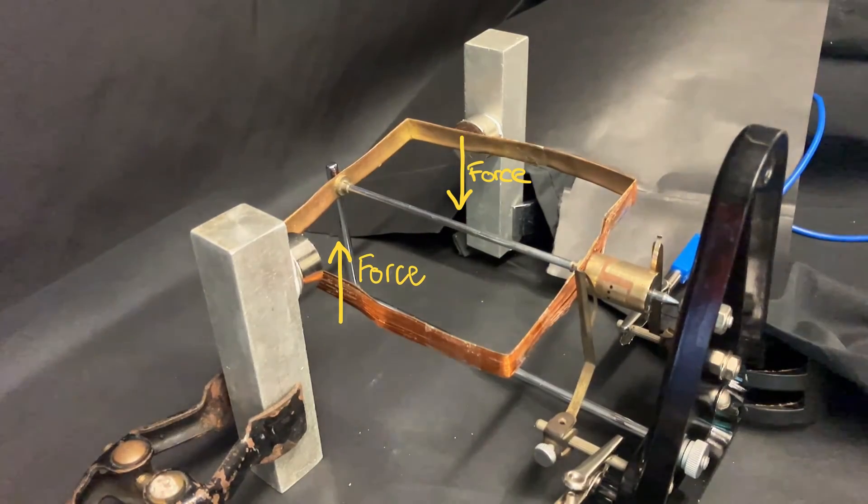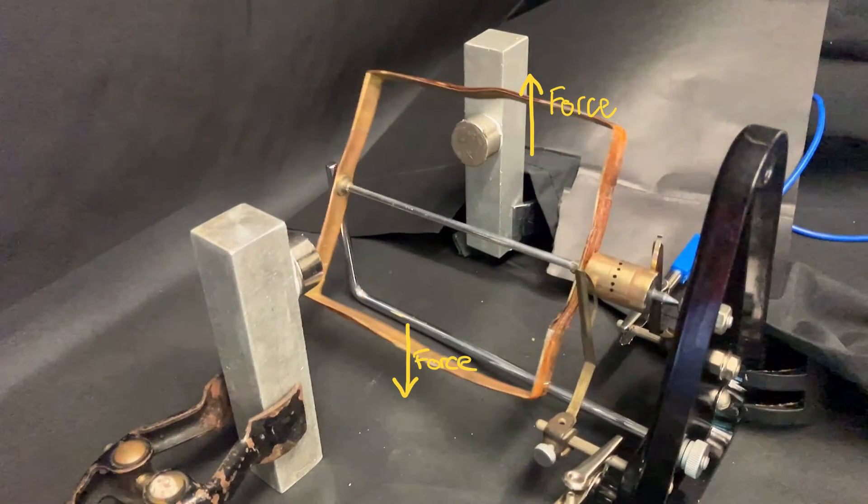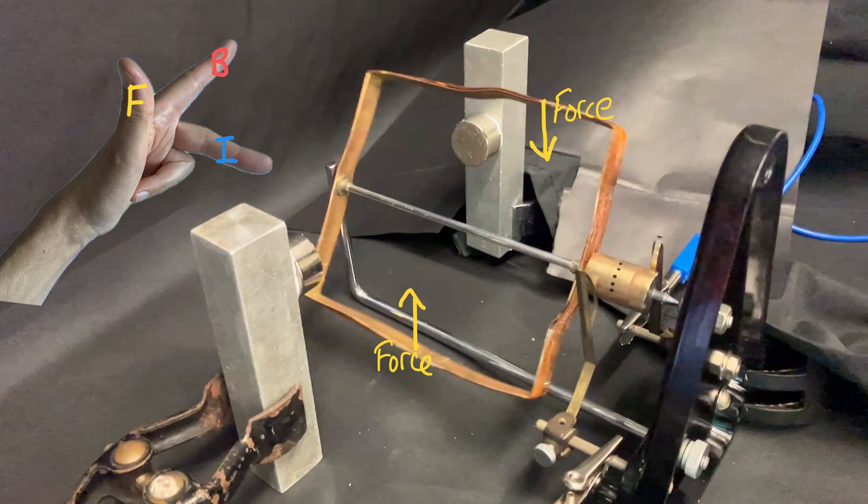Let's stop the video just after it passes the vertical position. The problem is that it's now creating a turning moment in the anti-clockwise direction, which is going to slow it down and make it come back. But what if we could magically reverse the direction of the forces? Then once again we would have a clockwise moment which would keep it turning in the right direction. Thinking about Fleming's left hand rule, we have two options: reverse the direction of the magnetic field, or reverse the direction of the current. Switching the poles of the magnets round is going to be difficult to do automatically, so somehow we need to get the direction of the current to reverse.